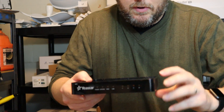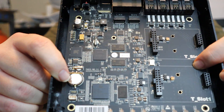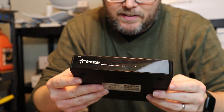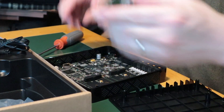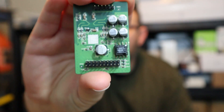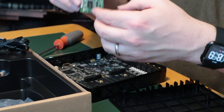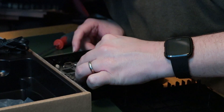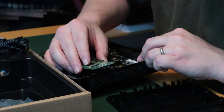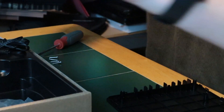There are those long screws, and that's what the inside looks like. I was correct — for the S20 having two modular slots, you can see slot one and slot two. There's also a tiny BIOS battery in there, which is fantastic. There could be some compact flash underneath as well. We're going to take our module, line the pins up — short pins in the front, big pins in the back — and go into slot one.